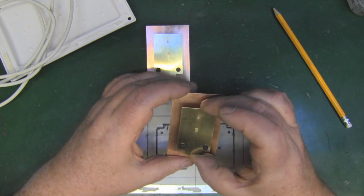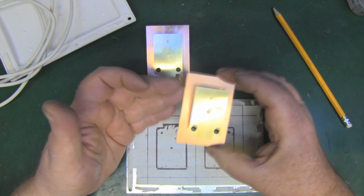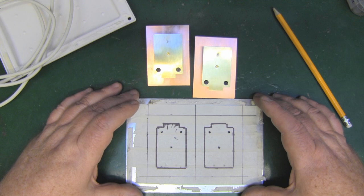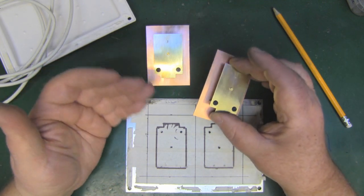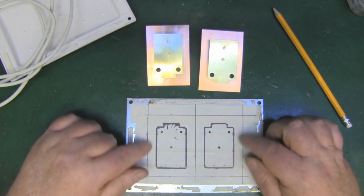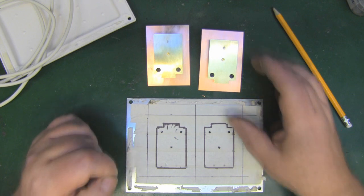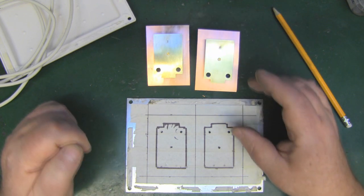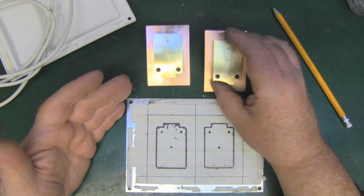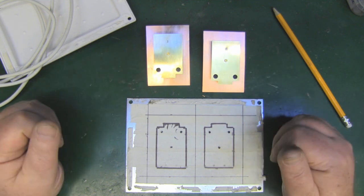Because I've reduced the size of the back reflector compared to the original, I've probably lost around 1 dB of gain. I originally considered cutting reflectors from 3 mm aluminium but went with copper — it looks a bit nicer. It'll be interesting to test whether modifying them has changed the frequency, and also to see what breaking the connection between the driven element and back reflector does.